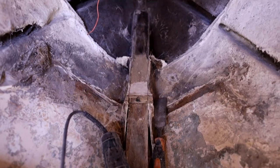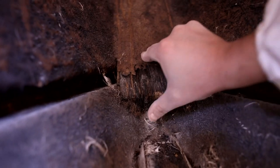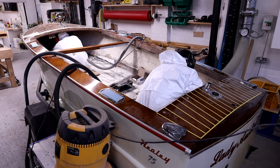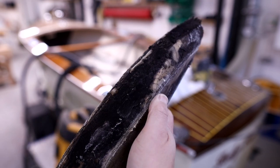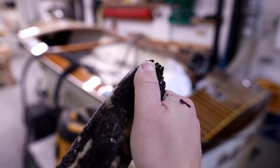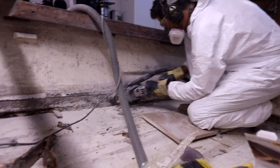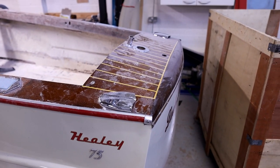It was just a continuation of cutting bits out — every bit of timber that was in there that we couldn't see, we wanted to remove. Sure enough, as you can see from the stem timber, pretty much everything we found was rotten or on its way to being rotten. You can see me and Will both in Tyvek suits and masks — just a couple of weeks of grinding fiberglass and cutting pieces out. The timber up from the skeg into the stem was in pretty bad shape, feeling really damp as soon as you cut the polyester off. Then we ground the hull back to get a really nice finish to work from — plenty of dust and many hours spent itching.